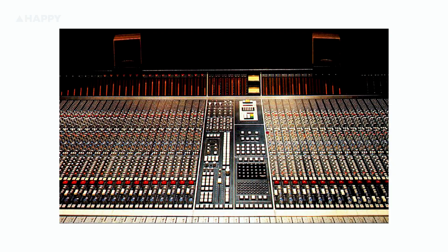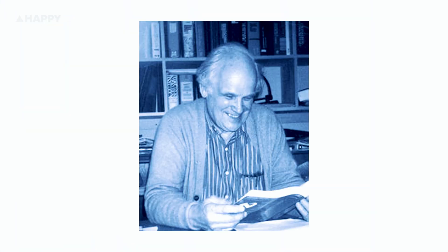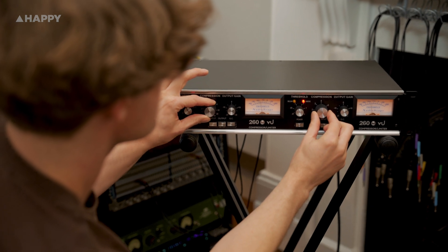And little extra harmonics kinda come through too, and they're totally unlike other VCA compressors that followed, like the SSL G-Bus or the API 2500. The 160VU is, as far as I know, the original VCA compressor, using the proprietary 200VCA gain cell made by company founder David Blackmer — the DB in DBX, which also stands for Decibel Expansion. Something Blackmer set out to do: increase the dynamic range of recording media, which ironically is the opposite of what I'm going to do with this compressor.